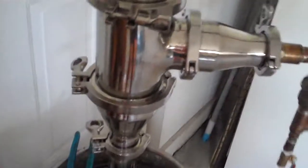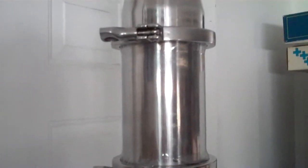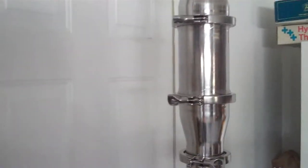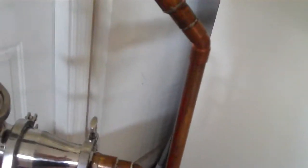And so, like I said, as long as the purity level remains very, very pure here at the top, the vapor temperature will never exceed 177, 178, probably no more than 180. Now, as you get towards the end of the run and you start to collect product off, you're going to be losing your alcohol, and once the alcohol starts to get depleted from the system, that's going to force temperatures up.